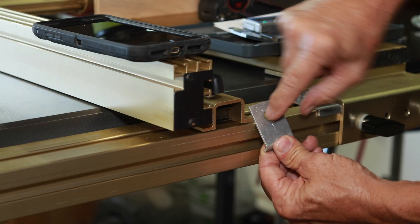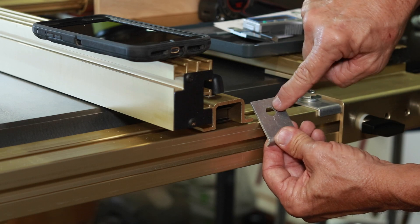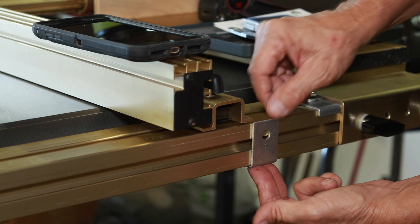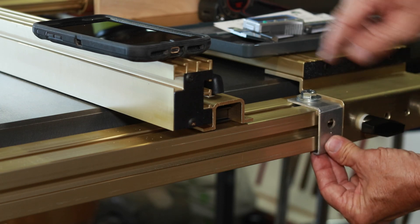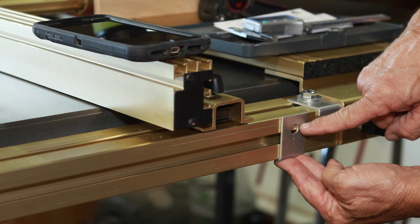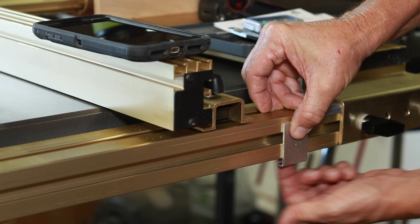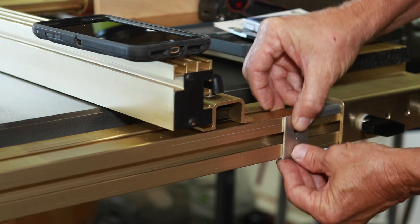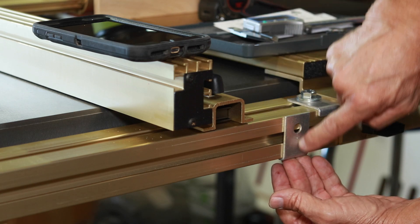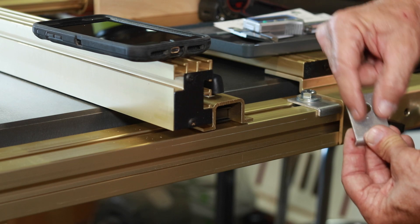Between the bottom line and the hole — that's where that hole is punched, and this is centered between all this. I'm going to take a three-eighths drill and drill that out. This is aluminum. I'll take a file and file out that little peak so it'll be flat on both sides. That way I'll be able to slide this up and down, push on the bottom, keep it flush, tighten it down, and it'll be flush with this. The fence can still get past it. The concern is that if the hole isn't set right, it hangs down and that's a catch point — I'd catch my pants or shirt on that. So I can keep it flush with the bottom of the rail by enlarging that into a slot, going over to the drill press.